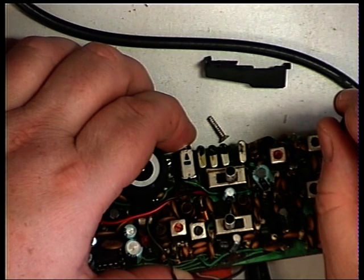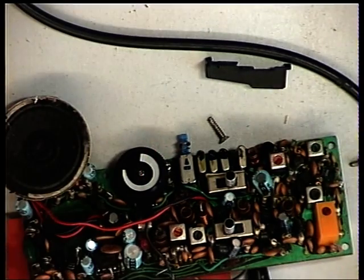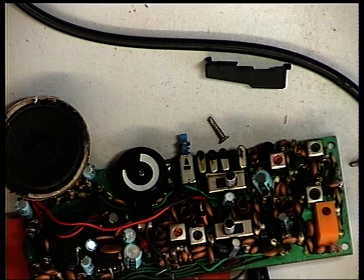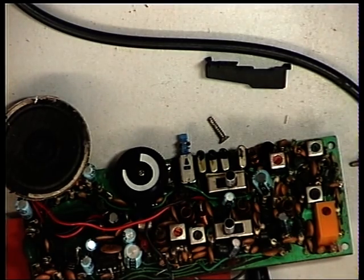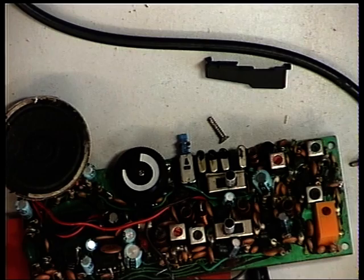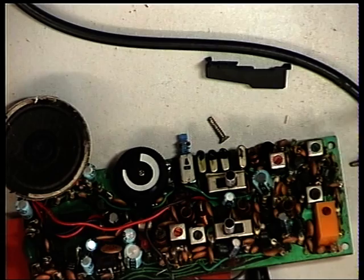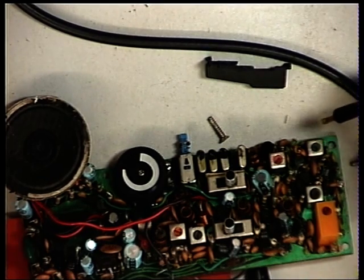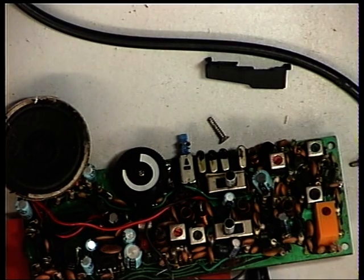Reading off the power meter, we are doing 50 milliwatts - so although it's been tuned up there's been no improvement over that 50 milliwatts. It's supposed to do 200 milliwatts, but this is a commercial power meter and I'm happy that it is transmitting at a usable power. So that sorted that out. Presumably the reason our engineer couldn't get it to work is because it was so off frequency that nothing was going to happen.